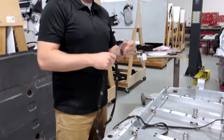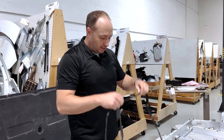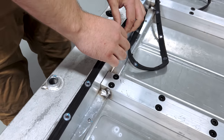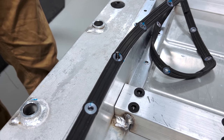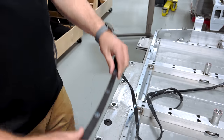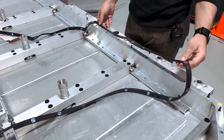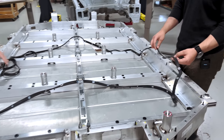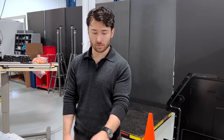Something we've learned a good bit about since the Hummer pack teardown is the safety consideration for internal pressures during thermal runaway control. This gasket is designed to loosen itself in the event of a thermal vent to allow gases to escape. They don't have as robust a thermal venting strategy as the Hummer pack, which had gaskets and vents on each module location. This type of injection molded seal is fairly common in hybrid battery pack applications — almost exclusively what we've seen from hybrid packs we've torn down.